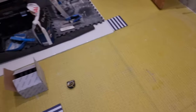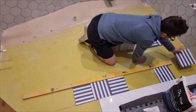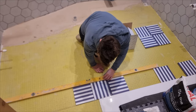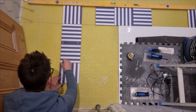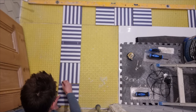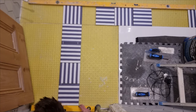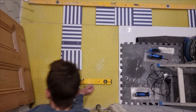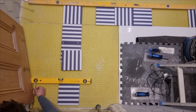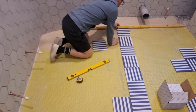The easiest way with these small tiles is to just lay some down and have a look. First thing I want to check is how it works out to the door, as it's also nice to have a full tile from the door. I'll also be checking how square the door is with the shower tray, as this is another visual point as you walk into the room. Working back with some 2mm spaces in the joints, it actually worked out pretty good. I'll then check to see how square it is to the doorstops by measuring back from my level placed on the tile - it's about 4mm difference and I'm fine with that, it's in tolerance.